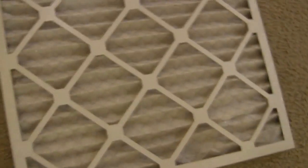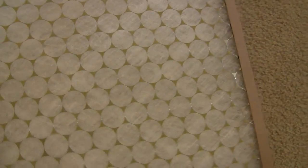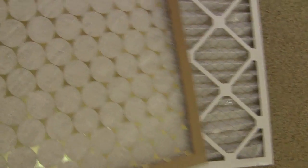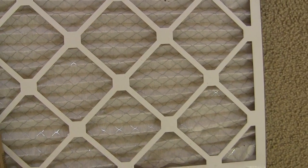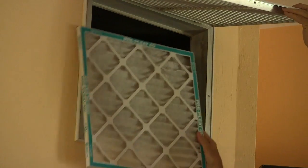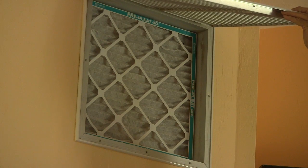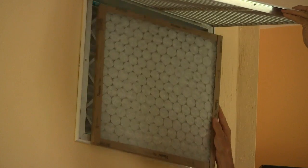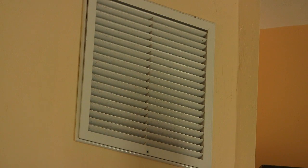What I want to do here is put both these filters together. I want to put this fiber filter in front of the pleated filter in an experiment where the smaller particles will pass through the fiber type filter, and the pleated filter will catch the smaller particles. So let's try that. I'll put my pleated one-inch filter in here, and then on top of it I'm going to put the fiber type. We'll see how this works out over, say, a period of about one week.